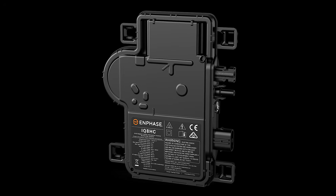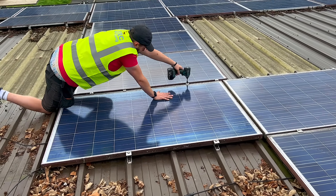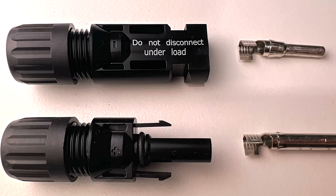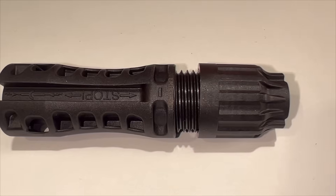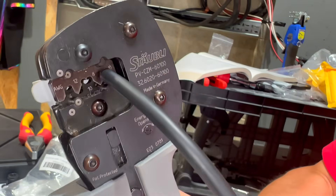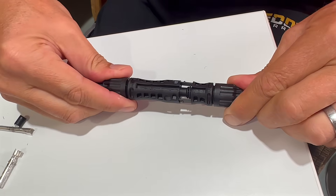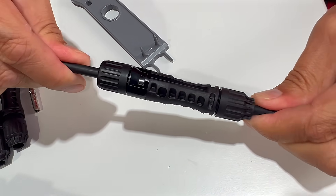It's important to note that the design of the original MC4 connector has evolved in response to advancements in solar installations, particularly regarding voltage. The original MC4 supports installations up to 1000 volts DC, while the newer EVO 2 version accommodates system voltages up to 1500 volts DC. However, a word of caution: the specific voltage and current ratings are governed by IEC and UL standards, which can vary depending on your region, so ensure you adhere to the correct standards. Thankfully, the original MC4 and the EVO 2 version are compatible — if a panel comes equipped with EVO 2 connectors, you can still use an original MC4 for the connection, just be mindful of the design voltage.